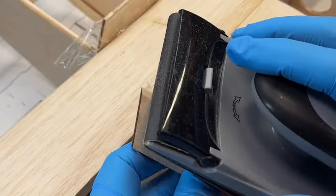Well, since this is going to be closed off, I thought what I would do now is just mark the center line or the thrust line of the engine. According to the plans, it's 7/16 of an inch below the top of this edge right here. All right, so I'm just going to go ahead and mark it with my square